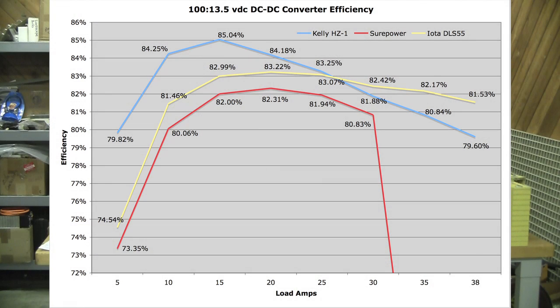This is a monster — a 25-amp rated unit that does 38 amps. In testing these three — the Iota, the SurePower, and this one — this was the highest efficiency unit as well. At about 15 to 20 amps, its claimed range, this thing's over 85% efficient. By that I mean you put in 100 watts of power from your pack battery and you get out about 85 watts at 12 volts. That's 85% efficient.